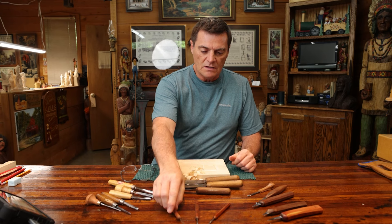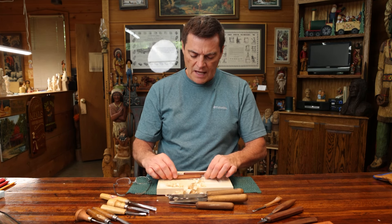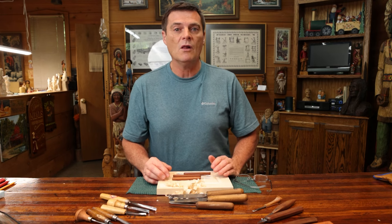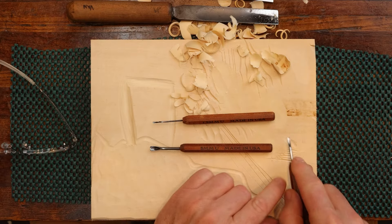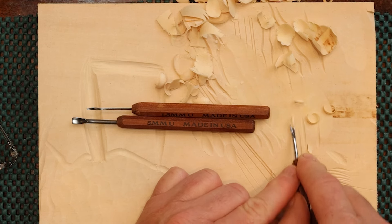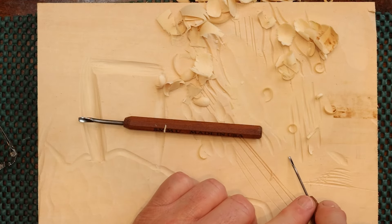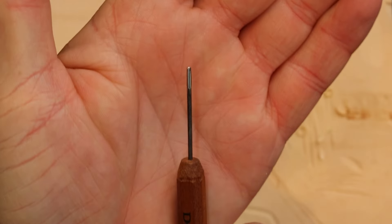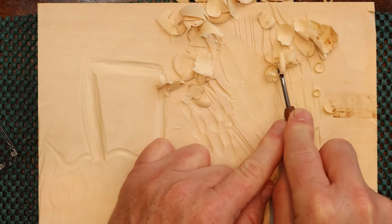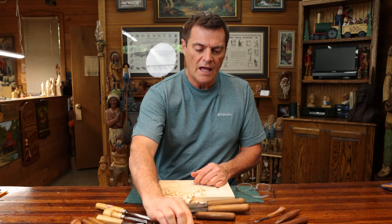Now here are some U-gouges that Dockyard makes. Dockyard makes dog-leg style tools, V-tools, and different styles. They come in palm size and range from one millimeter all the way up to seven or eight. You can see here on the camera they're used for delicate, smaller things. Be careful — when you go too deep your wood will tear. This number one here is used for putting pupils in the eyes. You'll find different ways of using your tools for your style of carving. They come pre-sharpened ready to go out of the box, and they're made here in America — a great tool to have in your tote or bag.